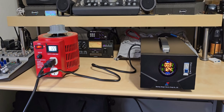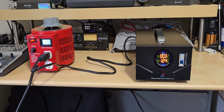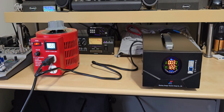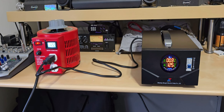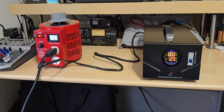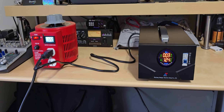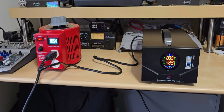I did reach out to the seller on Amazon, and I'm not going to fault this isolation transformer too much because it likely just has very poorly implemented control circuitry. It really should be shutting down on undervoltage around 75-80 volts, not 35. And on overvoltage, it should shut down at around 132 volts input rather than 145. No one seems to be talking about this, but this is the proof that the undervoltage and overvoltage protection works only semi-adequately.